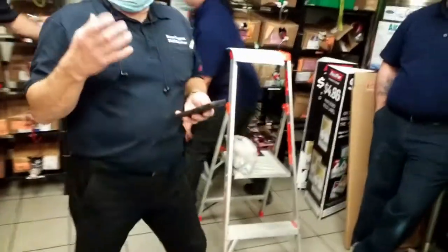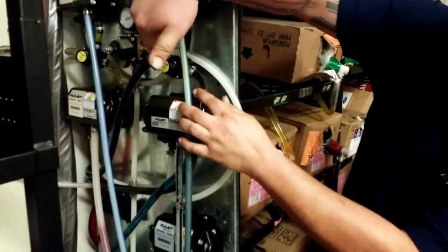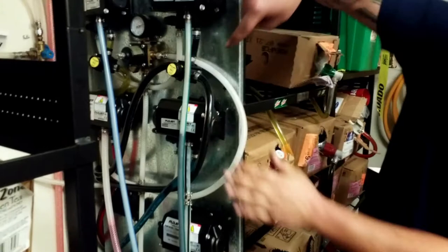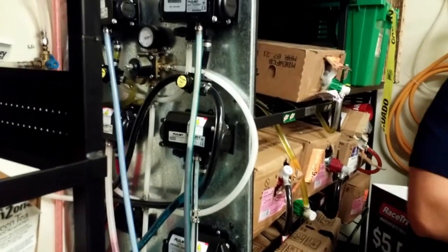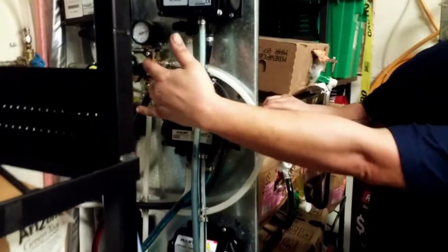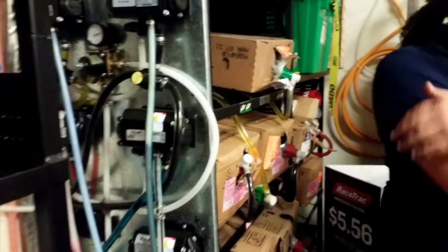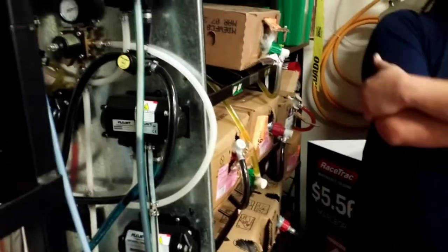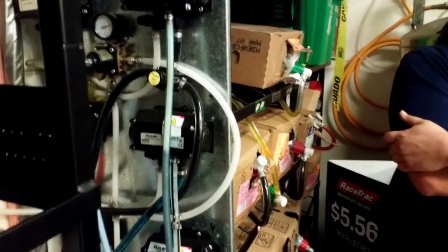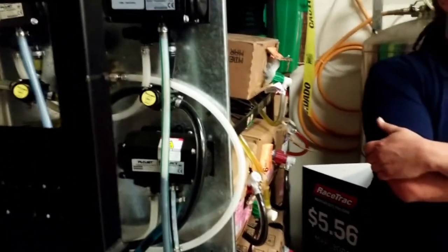So what happens is when that one bag empties out, this pump sucks the syrup out of the bags. So when one empties out, it creates a vacuum, like putting your hand over a vacuum, and that little changeover valve switches over to the full one. If that rubber diaphragm in there has failed, and you have one box above the other instead of beside it, that top one will drain into the bottom one, and that'll balloon up also. Ooh. It'll blow up. Right?